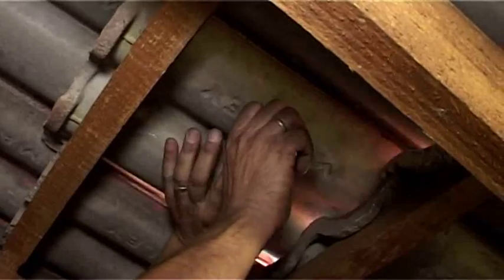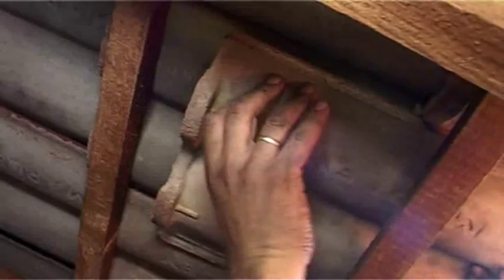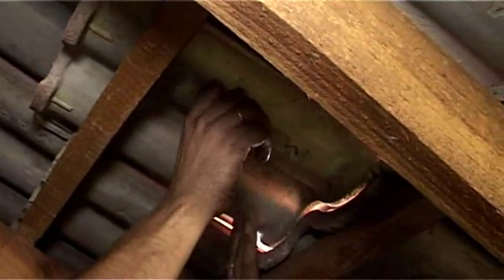A very useful tip is to open up the roof tiles. Although there's a bit of a risk element associated with water leaks, if done properly it makes the installation so much easier — you get rid of the excessive heat with a bit of ventilation in the roof space, and the natural sunlight that comes in makes a big difference in seeing where you're moving among the roof rafters. Lift the tile at the front part, gently slide it back, and when replacing it, just lift it over the front ridge and move it back into position.